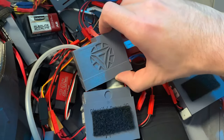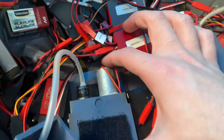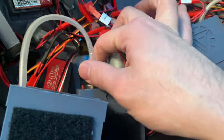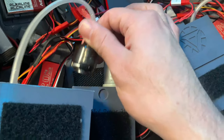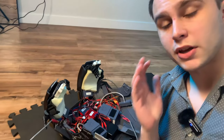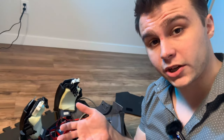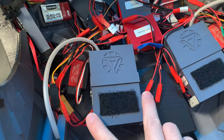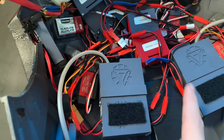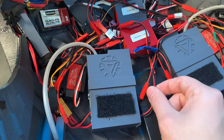So these fog machines can come off with just a bit of velcro. This top also comes off — it slides just like this — and this exposes both the air pump and the top of the vape. This part attaches with magnets and allows you to fill up the vape with the fog fluid. If you guys are interested in a video tutorial on how I built the fog machines and how I control them via Arduino, please let me know in the comments down below. You'll see there are four wires coming off the fog machine — two of them are for the power and the other two are the wires that control the smoke machine and the pump.